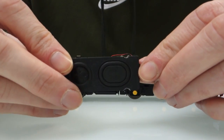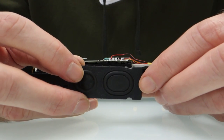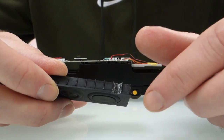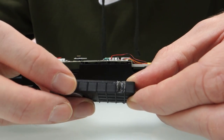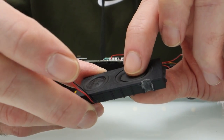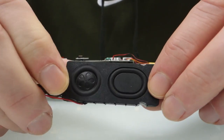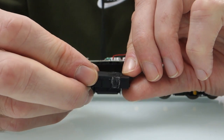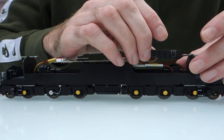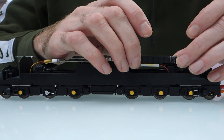Yeah, what I've done, if you can see, is I've used my soldering iron, which probably ain't very good for the soldering iron. But I've used it just to melt some little indentations into the side of each side of the speaker. And that did unseal the speaker, so you can tell, because when you push the passive part of the speaker down, you want the cone to lift up. If it doesn't, you've lost the seal. But I just put a little bit of glue in each of the little dents that I'd made, and that's fine again now. And again, I've test fitted it before I put the camera on, and it fits, and the little indentations do line up properly with the screw holes.